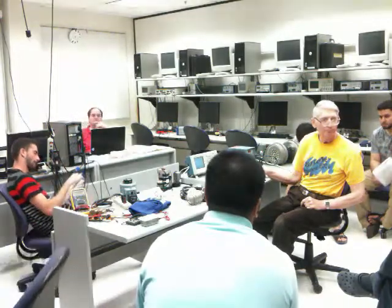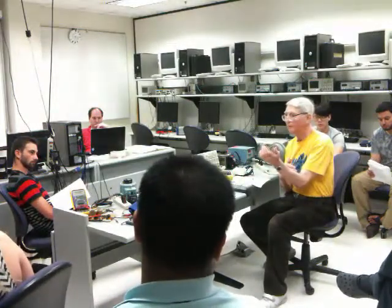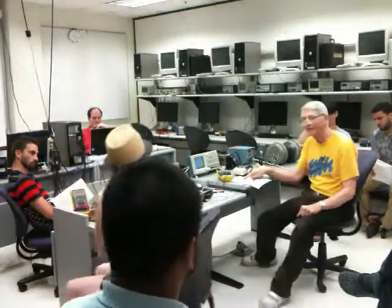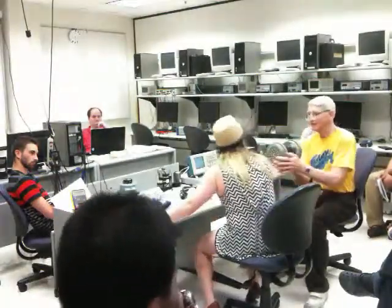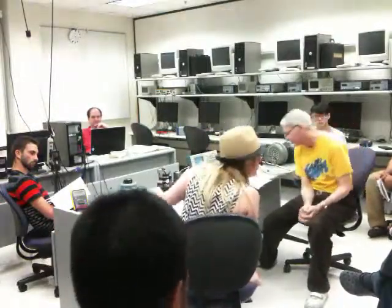How much current might it be taking? Should we verify the power factor? Yes. Probably. How do we do that? We can calculate the angle. You can just look at the angle of the current. How do we know if we got the right power factor? What will it look like? Would you please calculate that? The angle? 49.98. Roughly 50 degrees.